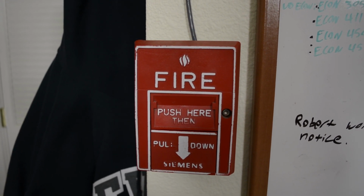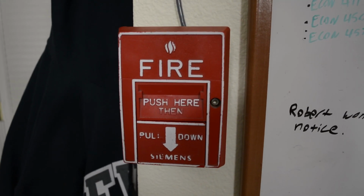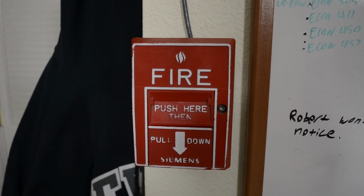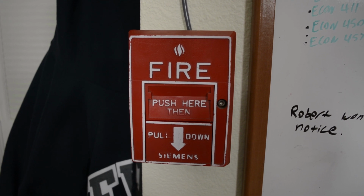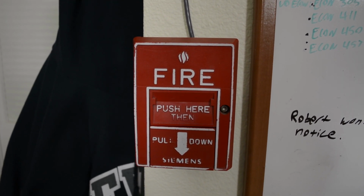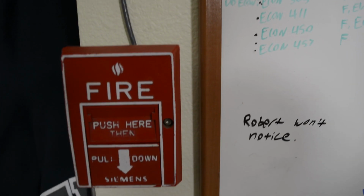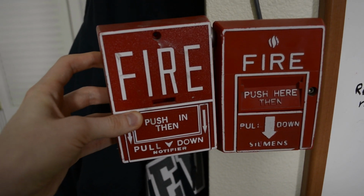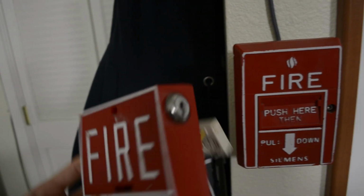The panel is all still the same, the Firelight MS5ED3, and for the first device here, I've got a Siemens HMS-D. This was formerly an addressable pull station, however I've converted it to conventional. It's not one of the MSI series, it's the HMS series. And it looks very similar to a Firelight BG10. This is actually a Notifier BGX101L, I believe, or NBGX101L, sorry.